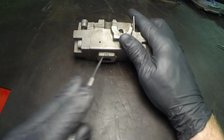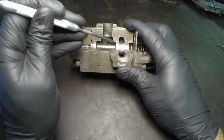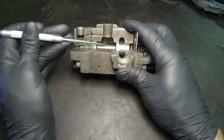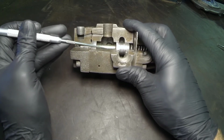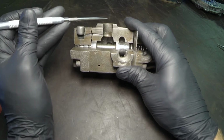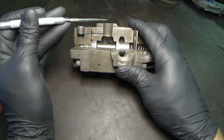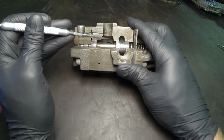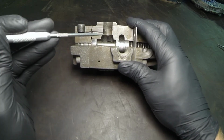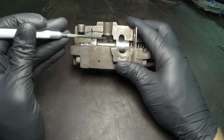It just sends to this cylinder first and then to this cylinder. But both of those pressures, because it'll just be an open cavity here, both of those cylinders will be connected in parallel. The pressure will be equal. And then whatever the system pressure is, so if we use that same system pressure we did in our relief valves, that 3000 PSI will eventually be able to get to both of the cylinders. The point of the sequence valve is not to control the pressure so much as to say which one moves first.